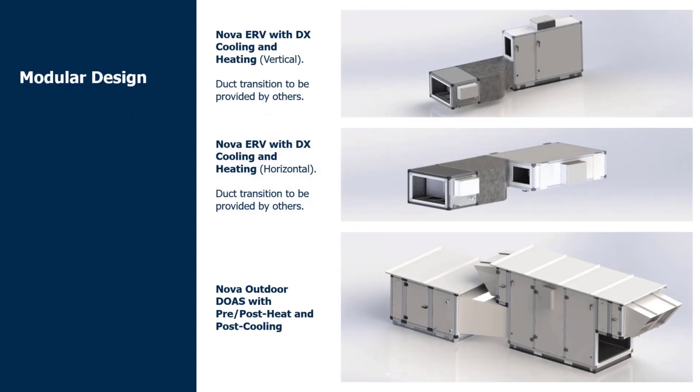You're also able to have it outdoors. You'll see here we can do VRV integration as well as hydronic integration, and the design of these components and accessories is a decoupled one. There is a transition required between the supply duct connection and the accessory whenever you're doing a cooling mechanism. Whether you have a chilled water coil or a DX coil for cooling, you have to have them decoupled. If you're just adding a hot water heater or electric heater, those can couple directly to the supply duct. Because cooling coils typically require a lot more capacity, we require them to be decoupled and horizontal to ensure the drain pan and condensate can flow out of the coil properly.